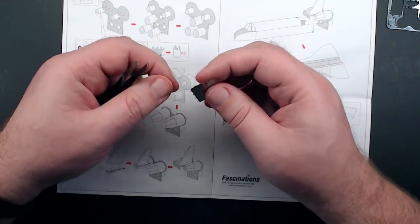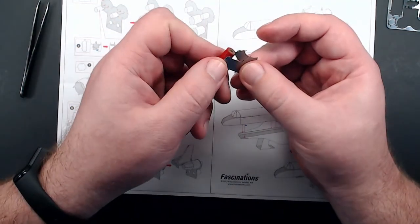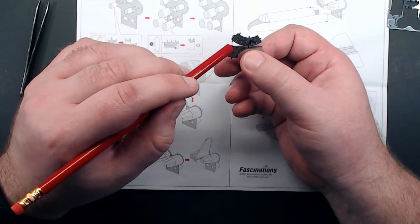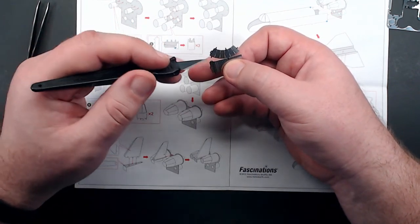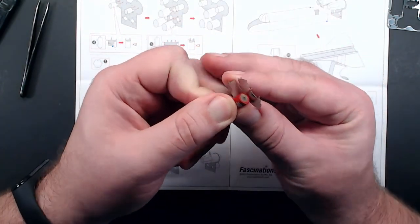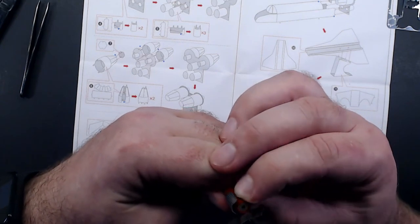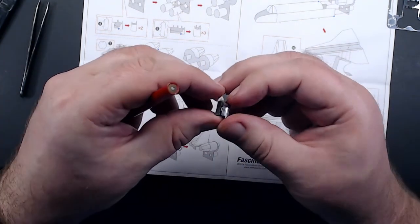Cones can be very difficult to form, even more so than cylinders. But we're going to come in here and we're going to say, hey, this is a cylinder. Let's start by forming. I like to form the bottom part of the cylinder first. And, well, shoot, let's look at this because I'm jumping ahead. This is one of the unique ones where part of the cone attaches to this cylinder. You can see this tab right here will actually go in this slot in the end when you secure it all together. And so I'm going to go ahead and shape out this cylinder, like I said, using this. And you can see here my cylinder is too small. But again, like I said, I like to overbend sometimes if I can. And I'm going to even try to bend this side that's got the piece attached to it there, and then unroll it just a little.